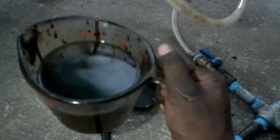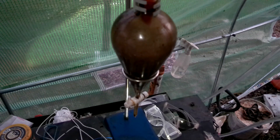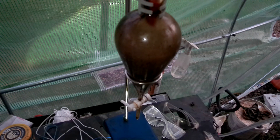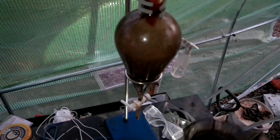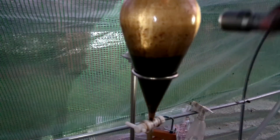What I wanted to observe is look at the viscosity of this — it looks like gasoline, almost like water. A lot of this is actually oil. You can see the water starts down here and the rest is oil, so that oil really does have that low of a viscosity. I am not Nile Red, so don't expect a clean pristine environment here. This is Mad Max Nile Red — messy environment, dirty funnel — but if it works, it works. This LDPE: we may not have gotten much oil, but look at the quality. High quality. There's the water fraction — you can tell because it has all the gunk in it. I have a little filter here to catch any gunk that can clog my funnel.